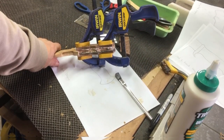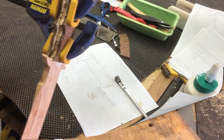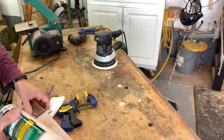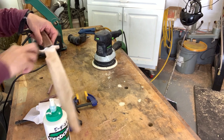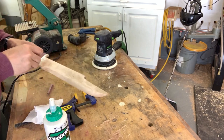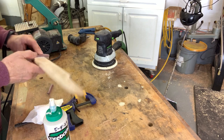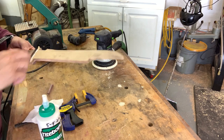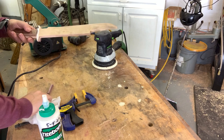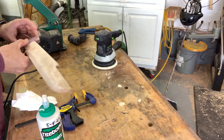Here's the simple process of just gluing on the scales — that's a shot of the glue-up. I have to wait a couple hours for this all to dry. Here I've cut a couple small pieces of purple heart to add a little color and flare to the knife. I have to trim them up with the bandsaw and a little bit of sanding. All I'm really doing now is just gluing these on; they're not the final shape, just close — I'm going to do a little sanding and filing as you'll see shortly.